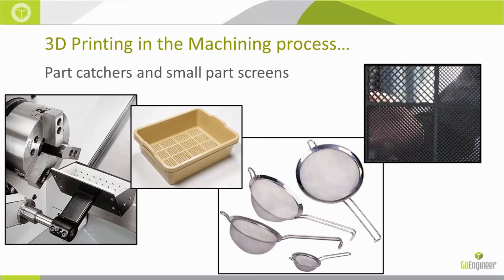And due to their size, of course, we were constantly losing them, and our yield on the job was pretty terrible. We started using devices like the ones shown in the two center pictures to catch parts, and though it was still a very manual process to separate the parts, we were able to increase our yield. We weren't throwing parts out with the chips. It would have been nice, however, to print a container with a screen at the bottom to catch parts and let the chips fall through.